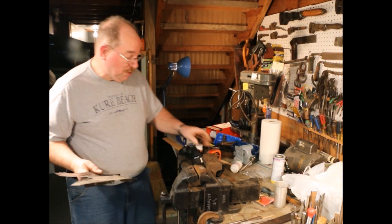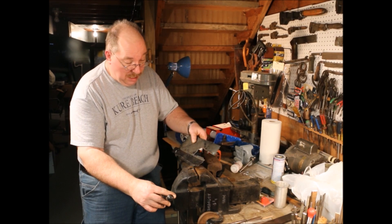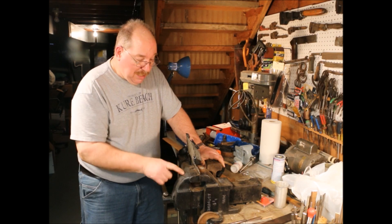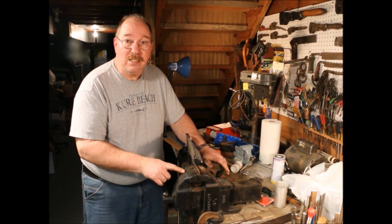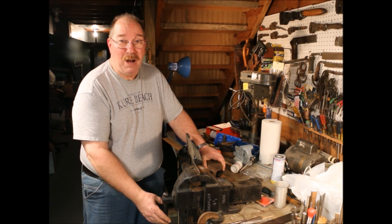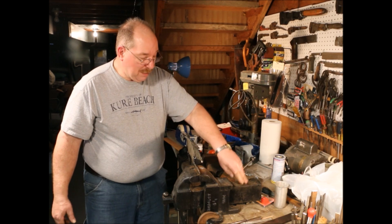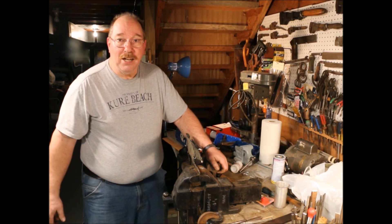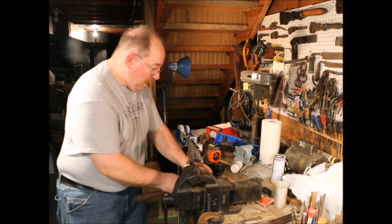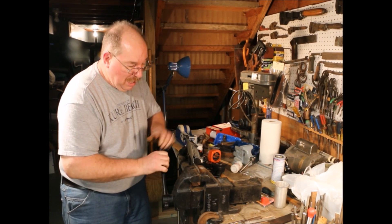The railroad iron is steel — it's resilient, it bounces. Cast iron is not resilient. One of the nice things about a cast iron piece is it doesn't bounce, it makes a great vise — it's very stiff and doesn't flex. It does have a limitation though: it has a tensile strength that is lower than steel. Steel will bend before it breaks; cast iron will break before it bends. With a steel vise there's always a warning — you'll see the thing starts wobbling and the jaws open up, usually because the beam has bent. With a cast iron vise, you're just cranking on it one day and it goes pop and no more vise. Keeping a short piece of railroad iron around your shop to beat on is always a good idea, unless you're one of those fortunate few that has an anvil. I have one in the blacksmith shop and a piece of railroad iron down here.